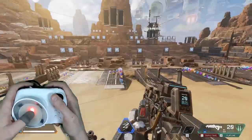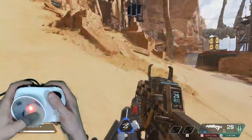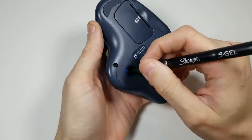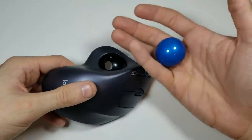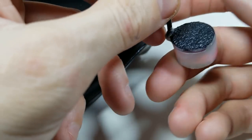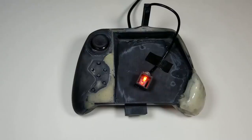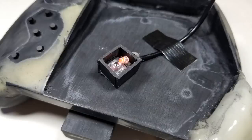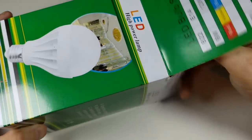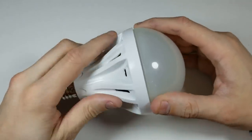This is where we came up with using a dome-like surface for our mouse pad over a flat surface, pulling inspiration from how a trackball works. The optical sensor is placed on the surface instead of inside the mouse. One of the major advantages of this method is we could remove all the electronics from the thumb mouse and place them inside the controller itself, reducing the height and weight added to your finger. Basically, we designed an inside-out trackball.